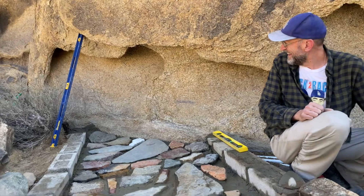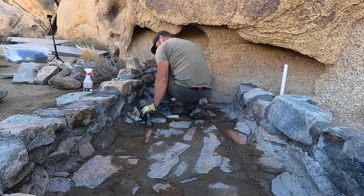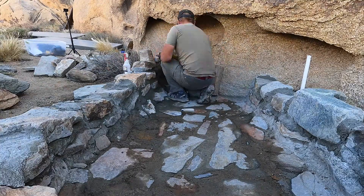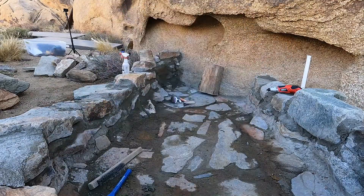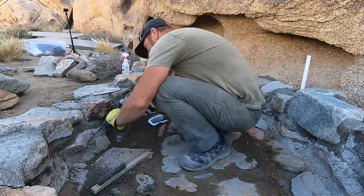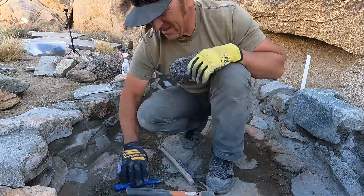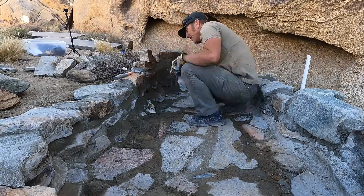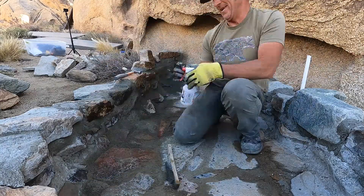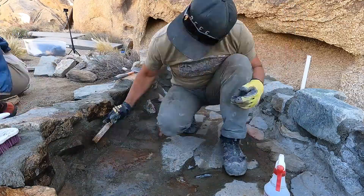Looks like your head will fit in there. This is really my first concrete stone project of any scale, especially one where there's a lot of high quality finished work. Joey gave me a book to read about stone wall building, and one thing I didn't know is how you brush the concrete after you do it. So that's what we're doing — chiseling and brushing it off. You can see how you use water because that concrete mix just gets all over the place, and these beautiful rocks turn gray because of all the cement and concrete that gets in them. You can see Joey spraying and brushing and revealing some of the rock again.